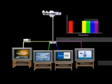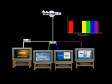The tuner in each receiver is set to receive all its programming information from one specific block of frequency spectrum. Since each receiver has its own specific block of spectrum, no signals above or below that signal range are used. Because the tuner is only looking at the predetermined frequency range, the other frequencies don't interfere. It's by assigning a specific block of the frequency spectrum to each receiver that we are able to stack all those blocks sequentially on one cable and feed them through the entire residence.